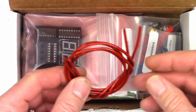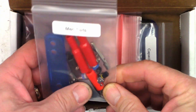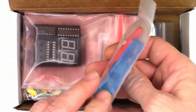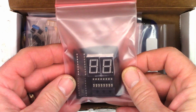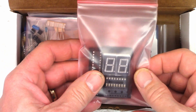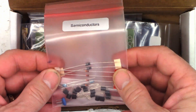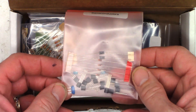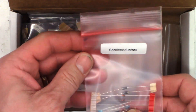So I've got some leads, some 1% resistors, alignment and test resistors, miscellaneous parts. There's some binding posts, a couple alligator clips, an end piece, some feet it looks like. There are two ICs, two IC sockets, and some LED displays. A couple of diodes — looks like 1N4148s, a couple maybe 1N4004s. A bunch of transistors, a little oscillator crystal down here, and a couple of LEDs. That's indicated in the semiconductor bag.